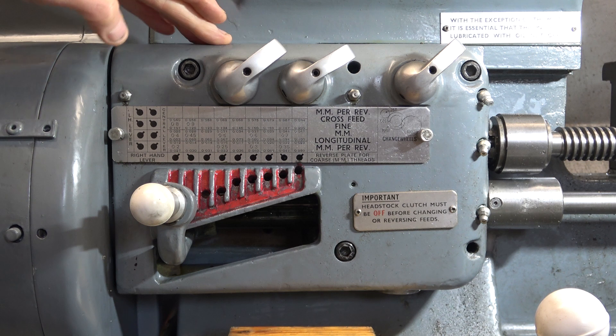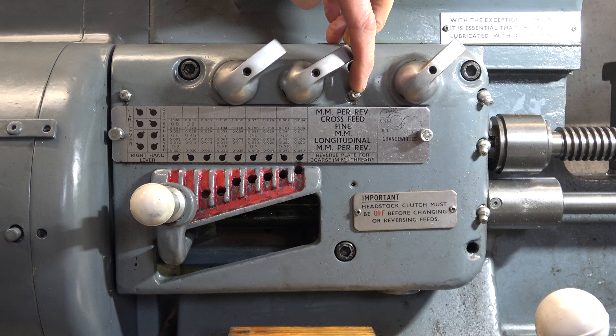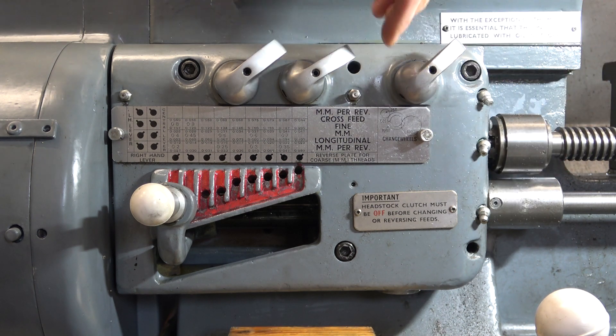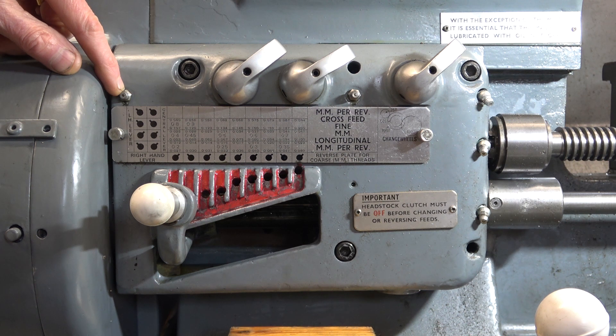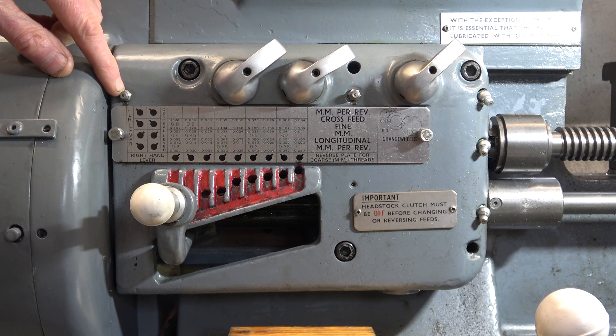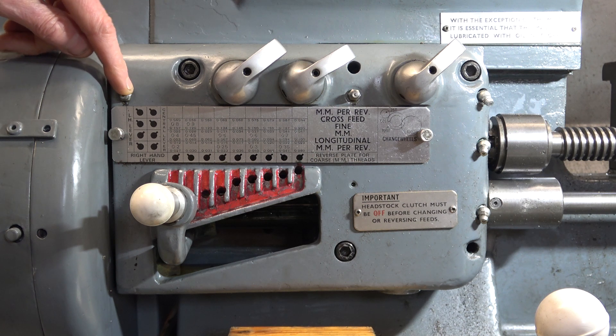Welcome to Haxby Shed. This is the screw cutting gearbox on my Harrison 140 lathe and you can see it's got a number of grease nipples here — five of them actually — but they're not for grease, they're for oil, and you'll really mess it up if you grease them. They're quite fiddly to use. A grease gun fitting will clip onto the nipple, but grease guns tend to leak oil all over the place if I put oil in them. If I use an oil gun with just a cup on the end, it doesn't seal when I try to push oil through the nipple, so I'm looking for a way to have a proper oiler system.